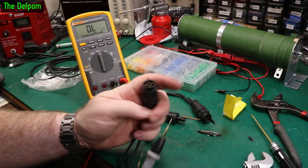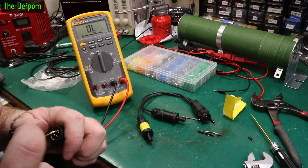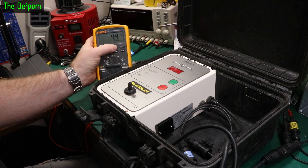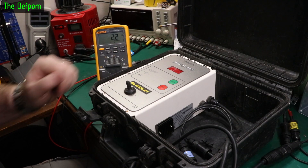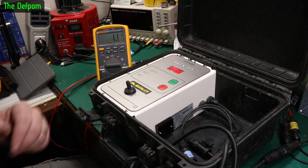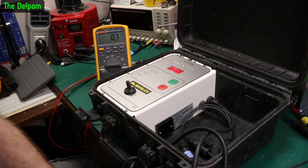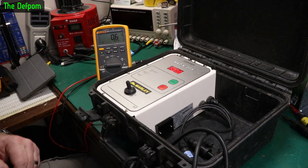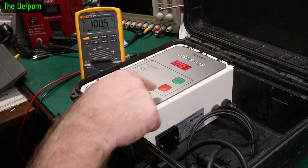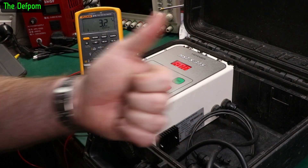Now whilst I've got it in resistance mode, let's measure the resistor across this one - the blue cable - the blue cable was 91K. Let's try testing it, let's see what we get. Now it's all back together - turn the power on, see if it detects the cable or not. It does detect the fitting. Let's wiggle the wire around in case there are any other problems we haven't noticed yet. That all seems fine. Let's try doing a weld - let's see what voltage we get. 100 volts. No worries at all. That's working fine. That's all good. It's fixed.